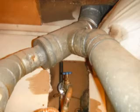This is a water heater. It's 6 years old, installed 2006 according to the note here. We have a damaged flue. You can see it's collapsed here. That means it's actually going to spill fumes out this side. You see the flue gases have been damaging it here. So this water heater is actually dangerous. It shouldn't be used. It's on, but I'm not going to fiddle with it because of this dangerous condition. I recommend that it's serviced by a plumber.